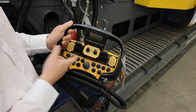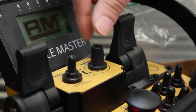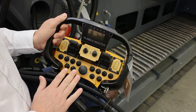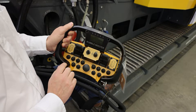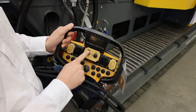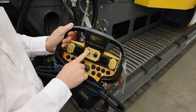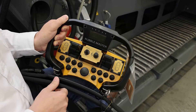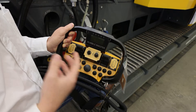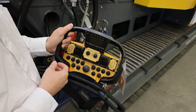This is your hopper on/off — this button will only work if the main discharge conveyor and crusher are both running. In the center, this dial will adjust your overall feed speed; it's a stepless adjustment that defines how fast you're going to feed into the crusher. The button next to it has two functions: pressing up activates max speed, so the hopper speeds up to the max regardless of your dial setting — this helps push material into the impact crushing chamber and can help dislodge a blockage. Pressing the same button down activates zero speed, so the machine stops conveying material forward but the hopper keeps running. Pressing the button again speeds the hopper back up to its previous speed.